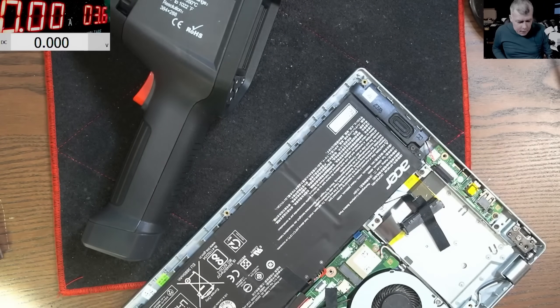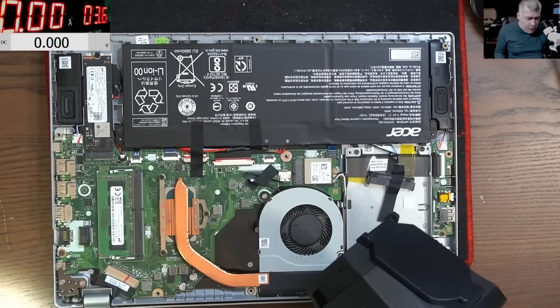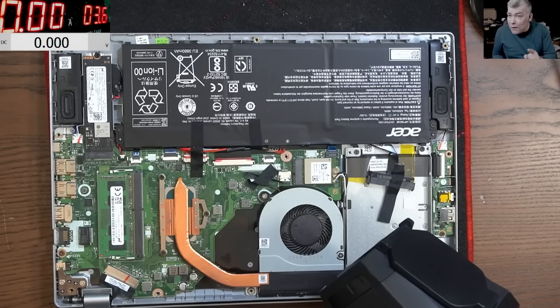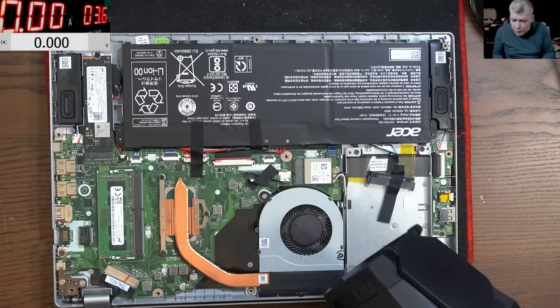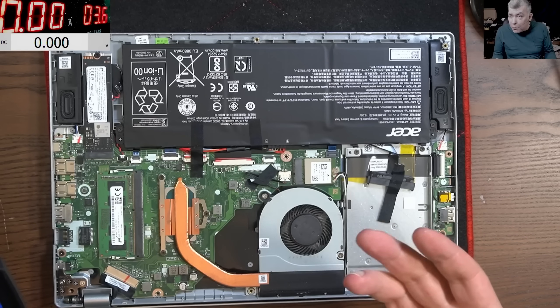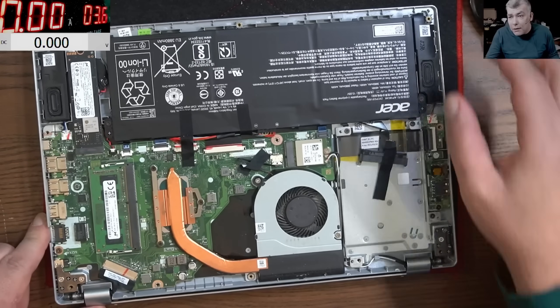What I want to keep in mind is the diagnostic method. If you have a component on the board like an inductor, it's very simple to see where the short is - which side is forward or backward. Come with current on both ends of that inductor and you can see on which side it gets hot. Very simple to figure out where the current is flowing.